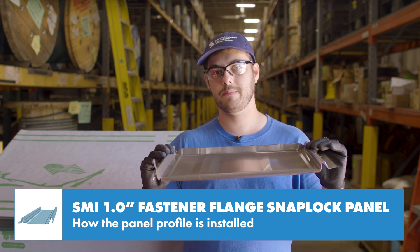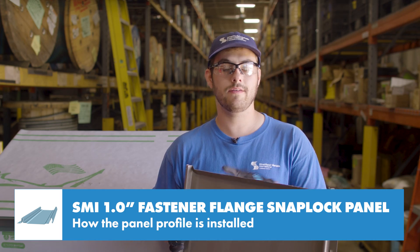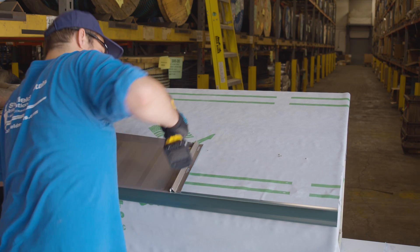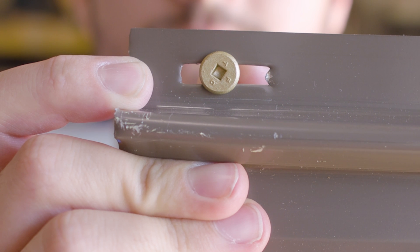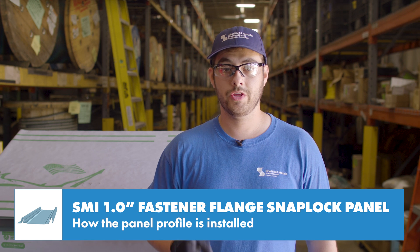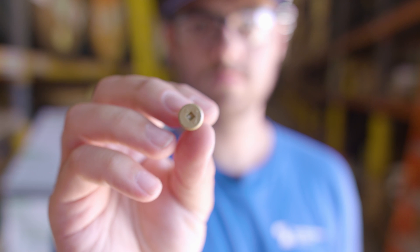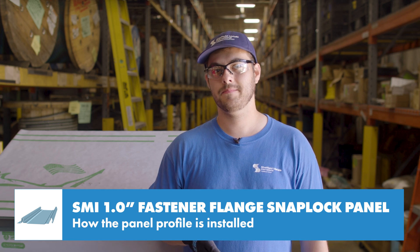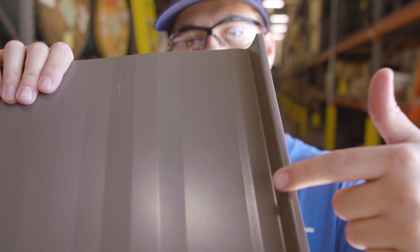I've already fabricated these panels with a 1-inch bend at the eave and a 1-inch box at the top, but if you want to learn how to do it yourself, there are a couple links in the description below. On the deck, the panel hooks onto the eave, is pinned down with a couple fasteners, and uses fasteners installed into the slots on the male leg. Make sure the fasteners are installed in the middle of the slot to allow the most expansion and contraction possible. You are relying on the head of the fastener to hold down the panel, so consider using a regular pancake head screw as opposed to an ultra low profile pancake head screw to give the most contact. When using a regular pancake head screw, you'll need to use the clip relief in your panel to ensure the fastener doesn't telegraph through.